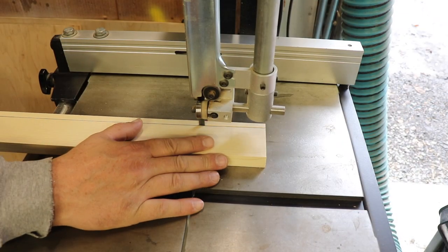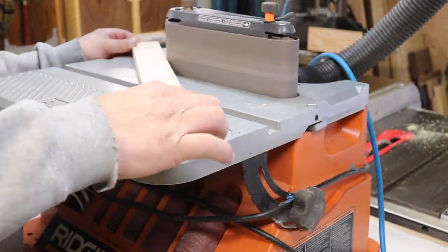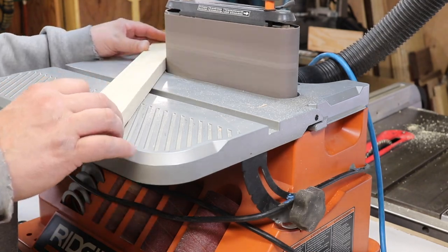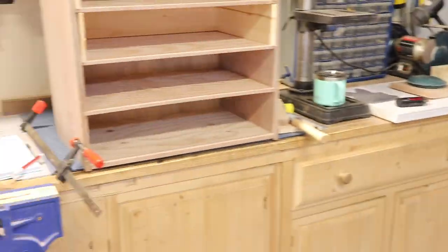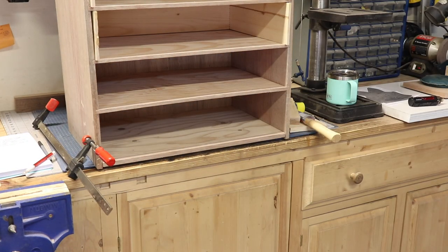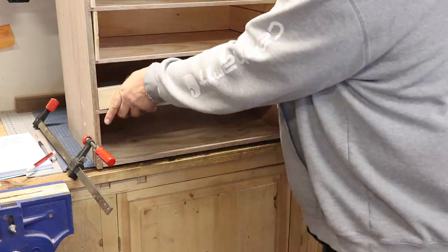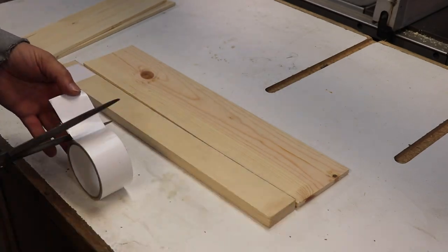So I'm going to go ahead and cut the template on a bandsaw, being sure to cut close to the pencil line, not on it. Then sand to the line with the belt sander. Cut the drawer front to an oversized dimension, then double stick tape the template to the drawer front and use a flush trim bit on the router for a nice clean cut. Then I'm going to lose the footage somehow of showing all you guys how well it fits.